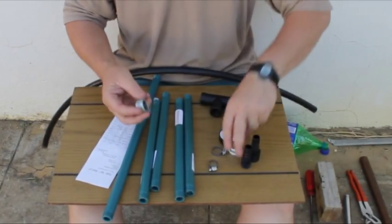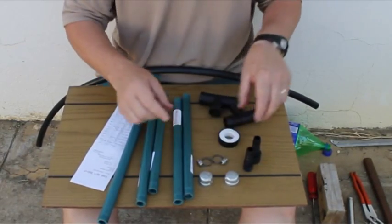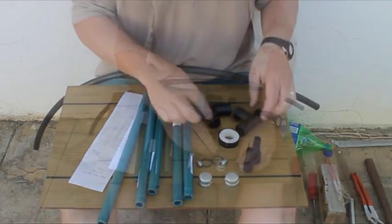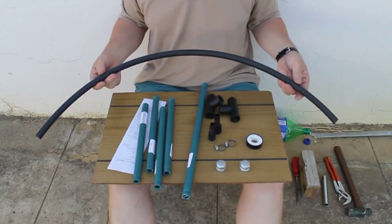You would need some end stops — the stoppers for 15 millimeter — and two cable clamps, then two T-fittings. These are all threaded so they will just screw together. You'll also need some thread sealing tape and a length, maybe about a meter or so, of half-inch pipe.